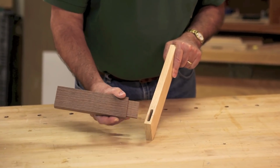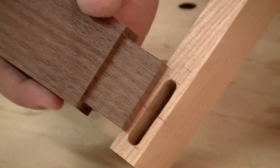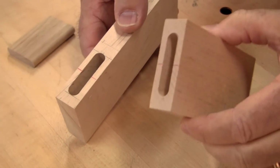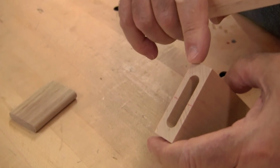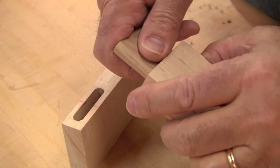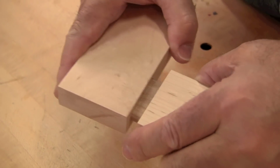But I've always hated whittling those terrific square-cut tenons to fit into my sweet, rounded, router-cut mortises. So pox on it, there's a better way. Route identical mortises in the parts you want to join, an edge mortise and an end mortise. Then make a separate piece, the loose tenon, to fit the mortises and tie the parts together. For me, it works like a charm.